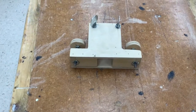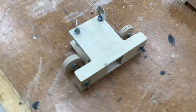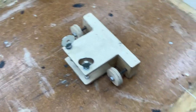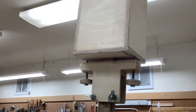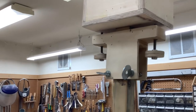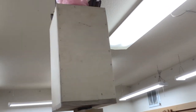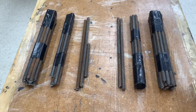This fixture holds the upper weight box in place. It slides over the pen pendulum bar and tightening the two thumb bolts holds it in place. The two threaded rods are used to make fine height adjustments. Other pen-to-paper ratios can be selected by adjusting the height and/or the weight of the upper weight box. Ratios of 3 to 1, 3 to 2, as well as 2 to 1 can be selected by just changing the weight — the position does not need to be changed. These are the weights used for the ratios.